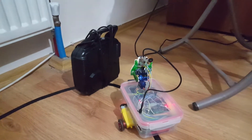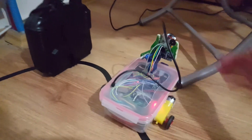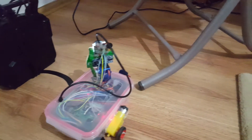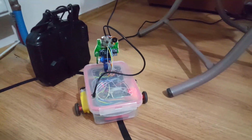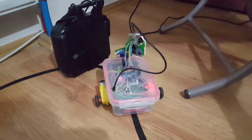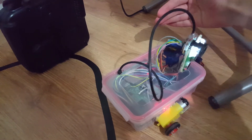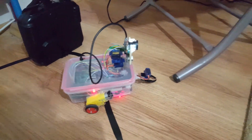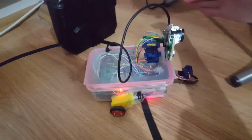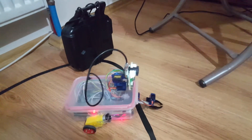If the robot sees an obstacle while following the line, it finds its way around. It checks for the appropriate direction — left or right — when it detects the obstacle. It detects obstacles using an ultrasonic sensor, the HC-SR04. If one side isn't clear, it goes the other way, avoiding the obstacle. It's a very simple algorithm but it works really well for the robot.